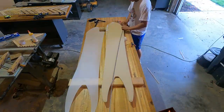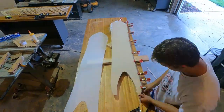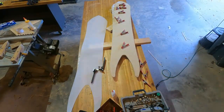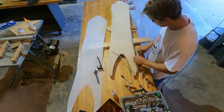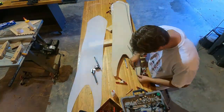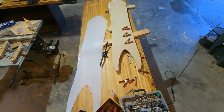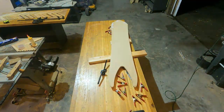After I cut the base out, I bent metal edges around to that shape. The edges are bent around the bottom sheet of plastic and glued on just to hold them there until I press all the layers together — the epoxy is the main bonding agent. These edges are very important because they are what help you dig into the snow and initiate and come out of your turns.